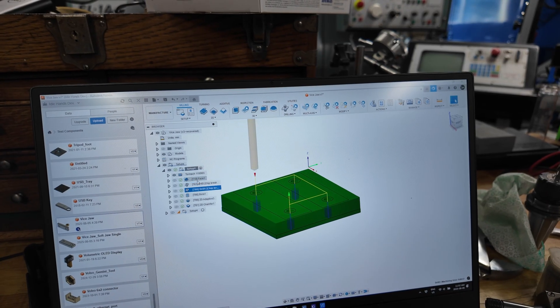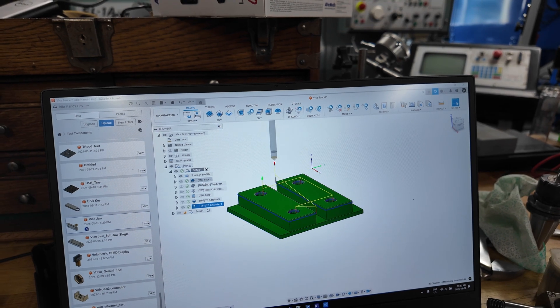All my parts were 0.75 millimeters on each end slightly bigger, and then when the chamfer tool came down it thought it was centering on a smaller tool, making a larger chamfer. Obviously it all makes sense — if I had just measured something along the way I would have figured that out. It's these little mistakes that you learn from the first time. I'm going to run the process again with the 8 millimeter tool since it's already in there, and then we'll see if we get a proper chamfer.